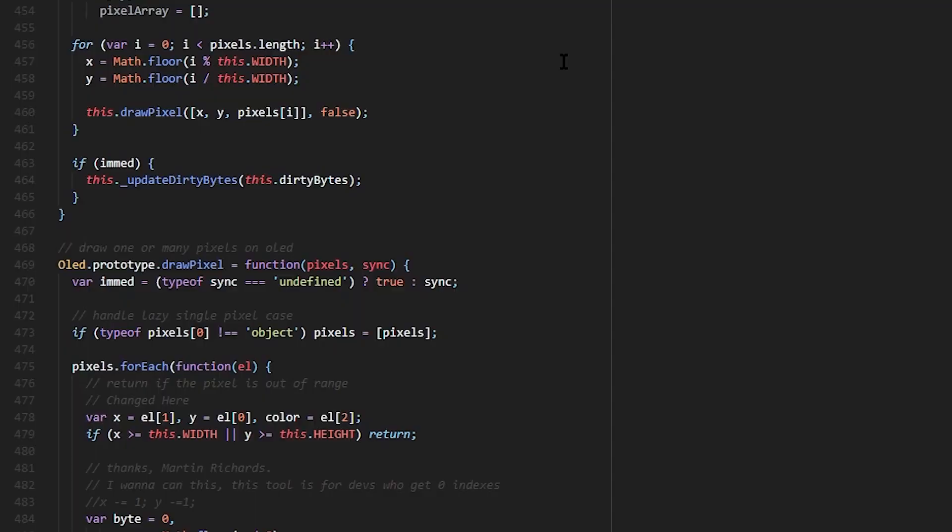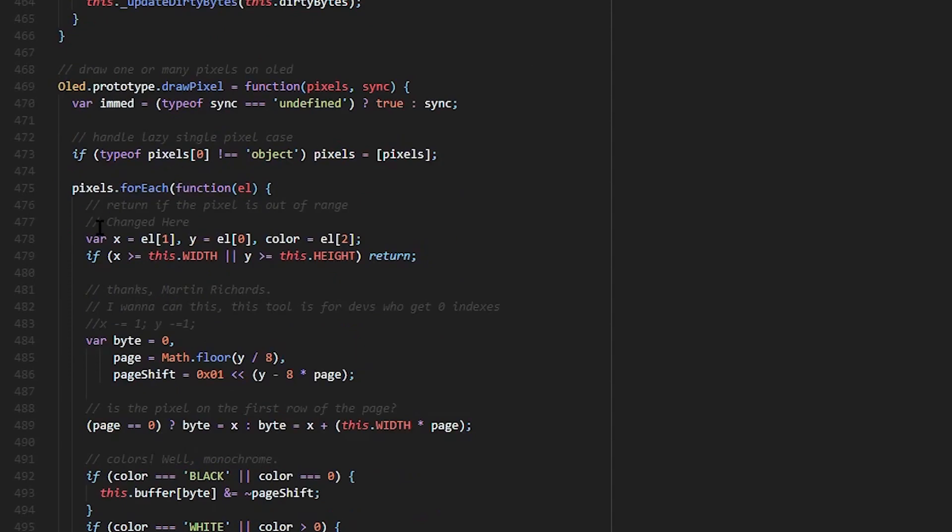A small hiccup was that there is no hardware support on that OLED display for a sideways orientation. I was tilting the display sideways so it would fit against my face a little better. To overcome that, all I had to do was flip the X and Y in the draw pixel function, which comes in that library I mentioned earlier. It's a little bit messy, but it worked, so I'm not complaining — though I might go back and make that a little better.